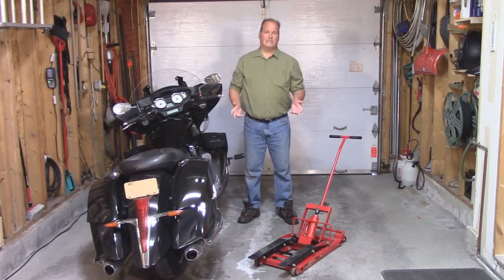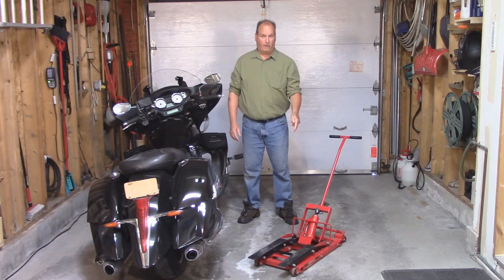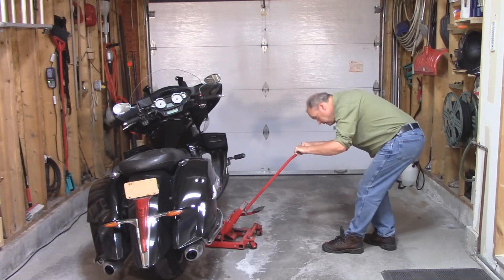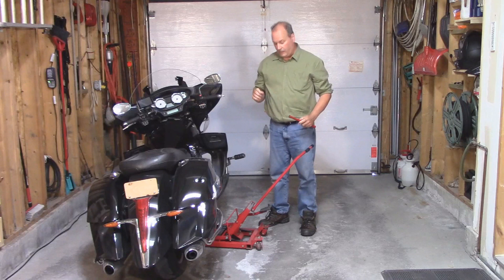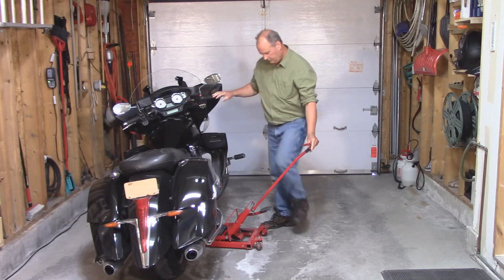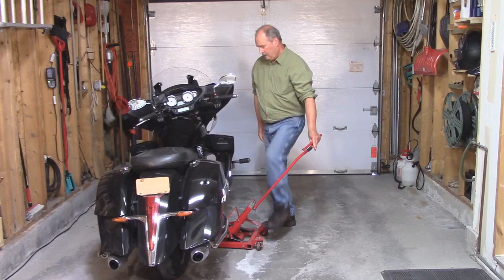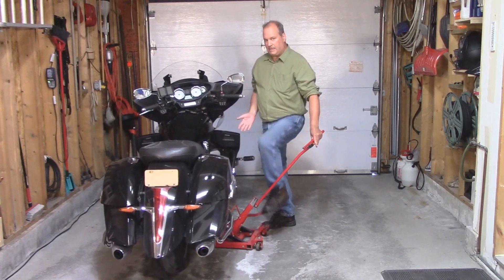There you have it. I was lucky — I had a 4-ton bottle jack and some steel lying around, so this cost me nothing. But even if I had to buy all of this, it still would have been cheaper than buying the replacement bottle jack they provide for this thing, which I've already had to do once. Let's try this out. First, lower the safeties — never rely on hydraulics alone for the safety of your bike. It's already lifting 2,250 pounds, but this is an 8,000-pound bottle, so I'm only using 25% of its capacity.